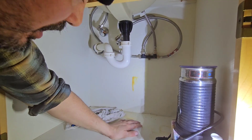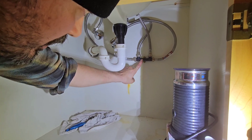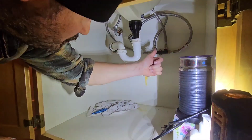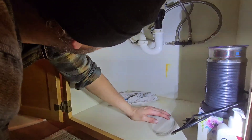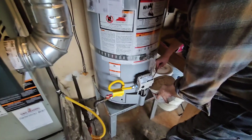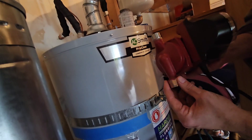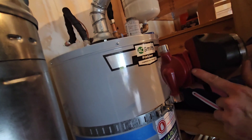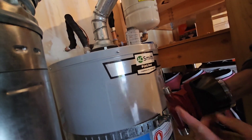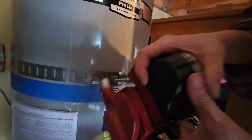So this is the hot water recirculation system. They will always have hot water in their hot water piping up to this point right here. Now we're at the water heater — this goes to the tank nipple and you can see the directional flow there. The pump is pumping water with constant pressure on the hot water side, so the flex connector will go here.